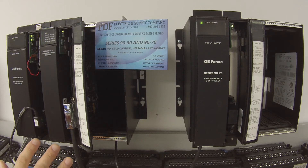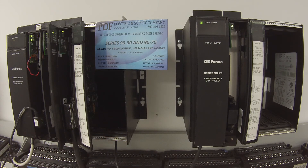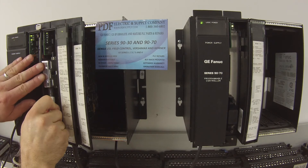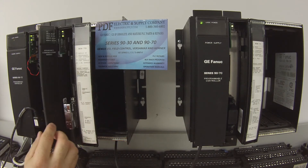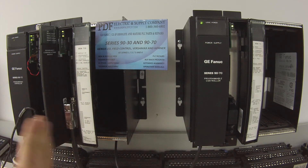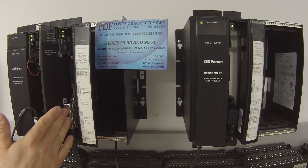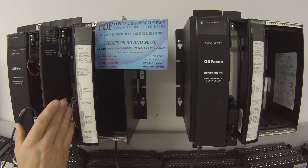This will allow you to test the port activity between all these modules. First, I'm going to connect the female end of the cable to the RCM. I recommend you be slow and careful because there are so many pins and it's a tight fit — be patient. Now that it's securely on, not only do I have a Module OK light, but I also have a light that says Expansion Port Enabled. It's telling me it's enabled because it's communicating with the RCM711 — they both see each other. That tells me the RCM711 is sending a signal to the BEM713 and the 713 is receiving it. I'm satisfied that the port activity is what it should be on these modules.